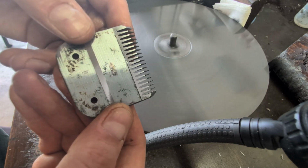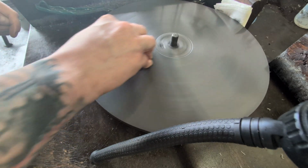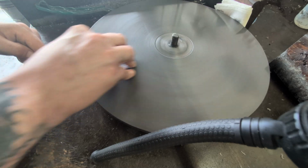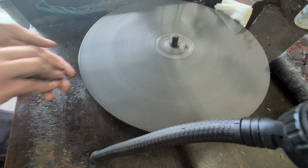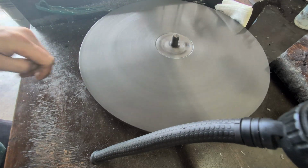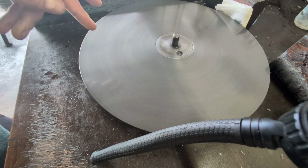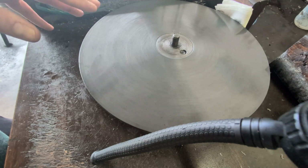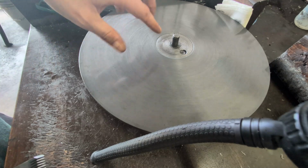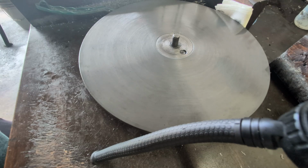See, I told you it's going to be about 3 times. So in general, if you don't use oil, I tend to have to use the other sharpening wheel, which is still great because they have the same shape. But if you want your blades for the longest life, then I recommend oiling, and you'll go on this wheel. If you don't oil, they will still last as long as this, but you won't get as many sharpenings out of it, because the other one removes more metal faster.